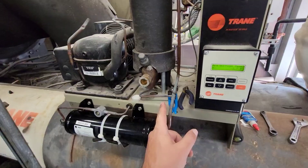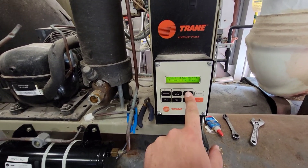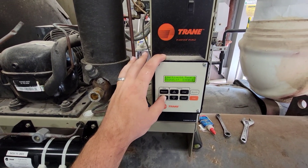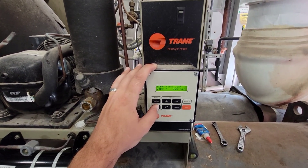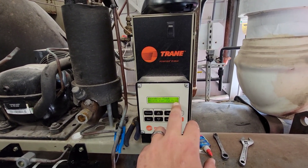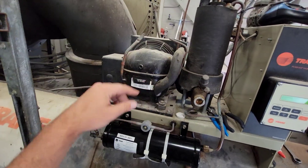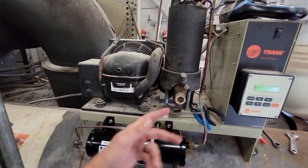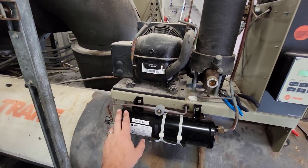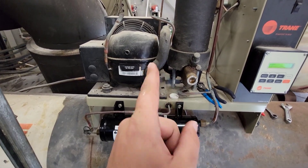In the meantime, the most critical part - put the label on - then I'll open the valves back up. For you experienced guys, you know I wasn't going to forget it. Once all this is done, you want to go into your settings and disable the pump-out alarm for the maximum 72 hours. I had already done it earlier but I'm showing you now. This is important because after changing the filter you're going to have a lot of pump-out initially, but once it gets that initial atmosphere and anything else introduced during the filter change out of the system, you're going to be good to go.